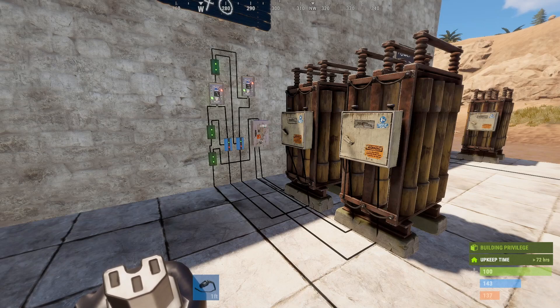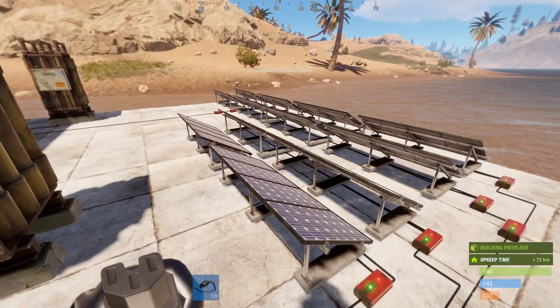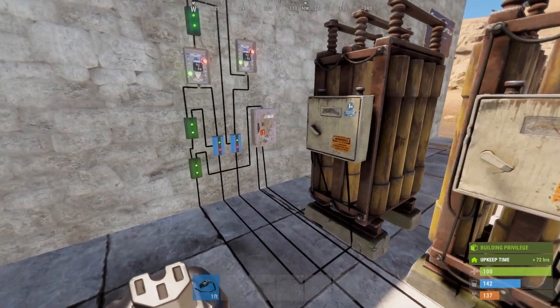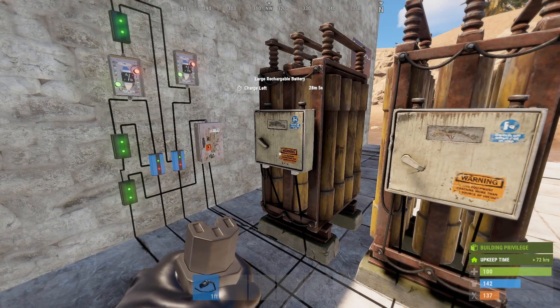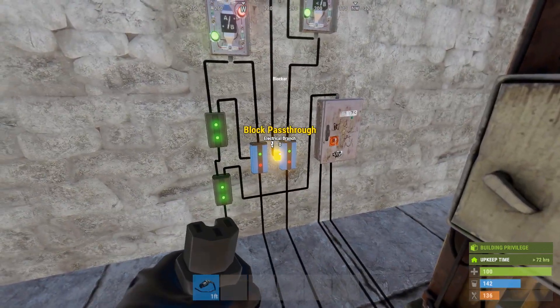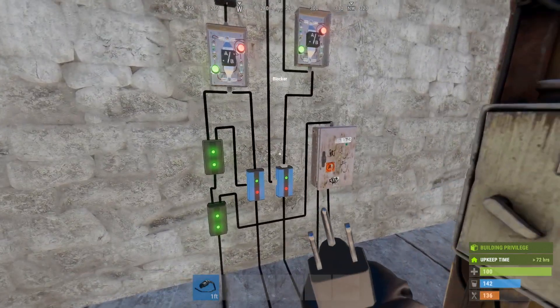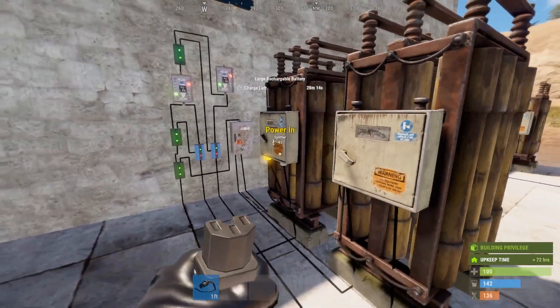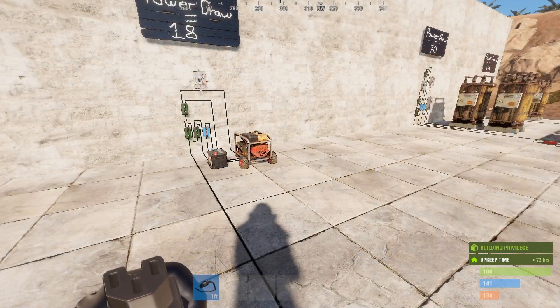It's a fairly easy circuit to wire up, but a little tricky to understand for beginners. Essentially what is happening is similar to the previous circuit — if the power delivery drops below a certain point or gets cut out altogether, then the first battery kicks in and takes over supply to the base. When this battery runs out, the power coming from the first battery no longer flows, which means it's no longer blocking power from the second battery. So the second battery will take over supply to the base and everything will come back online. If the mains power is reconnected, including the charging of the batteries, all returns to normal.